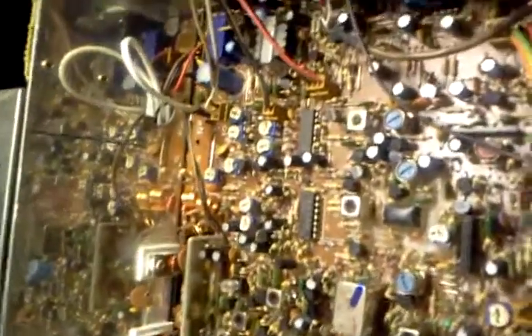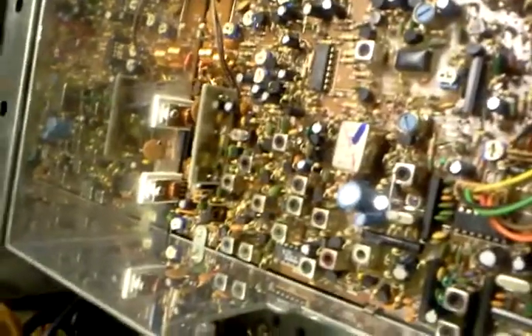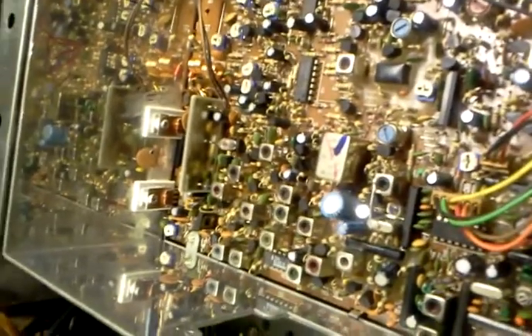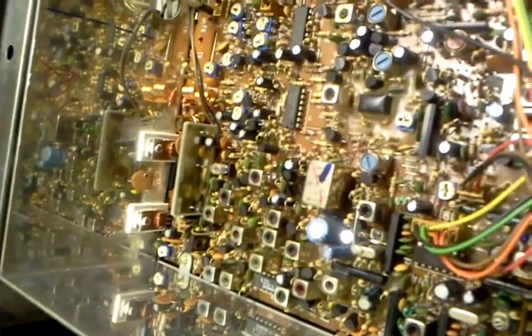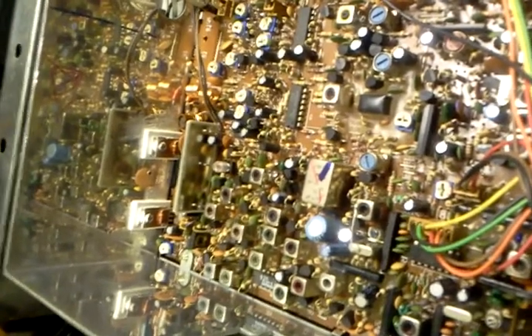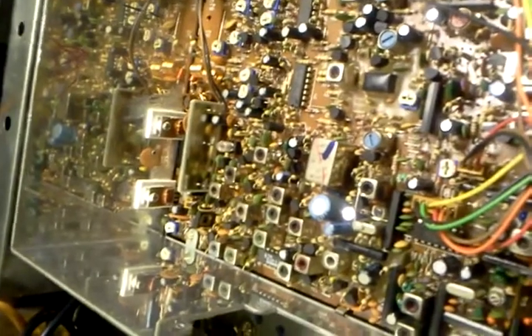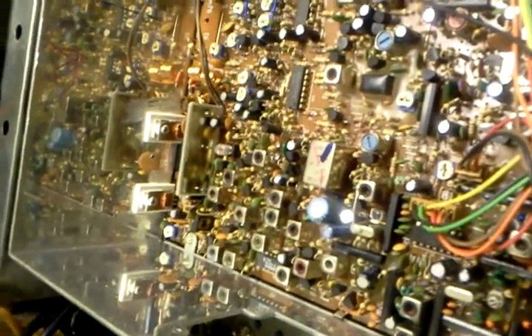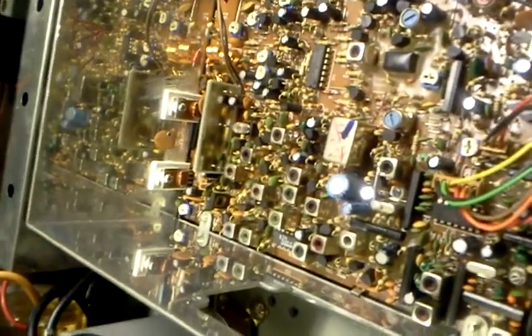While working on this one I had to turn to an old friend for help. Everything is very close together on this radio — kind of crammed into a small location. On some of these export radios they get crazy with their board stamping, and a lot of times it's so close together that a lot of them overrun and you can't really read what part is what. I'm looking for TR18, which in this radio is going to be a Q letter — like Q17 — and then D1, D2, D34, and D35.